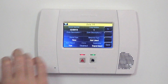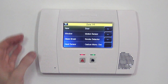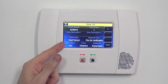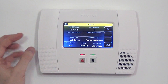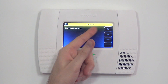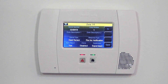Now we just have to select our device type. When we go into device type, the default is new. Any zone set to new will not activate the system. Once we select what it is, we get a response type and the sensor will activate. Once we go into our response type selection, with this device it's really only one option: fire, no verification. That just means when the alarm is triggered, it sends a fire alarm through to the central station if alarm report is set to yes.